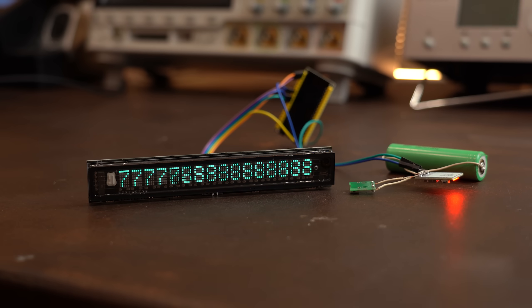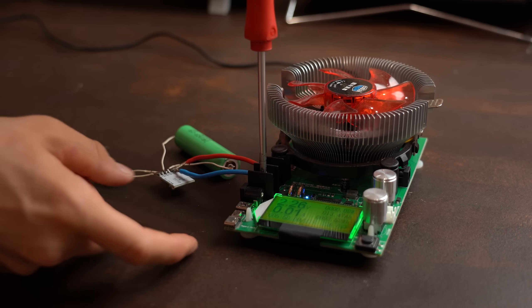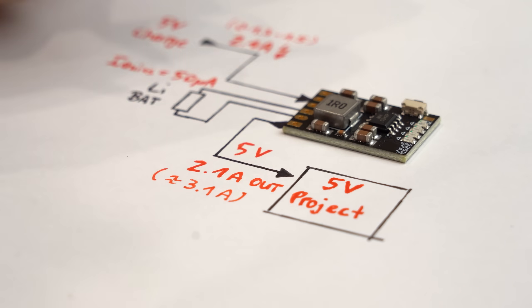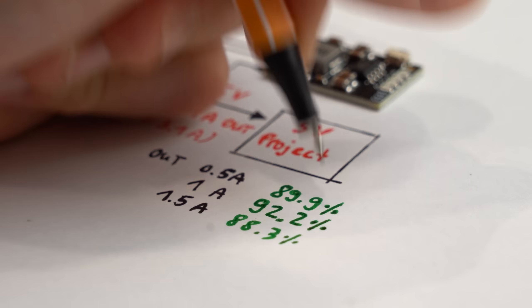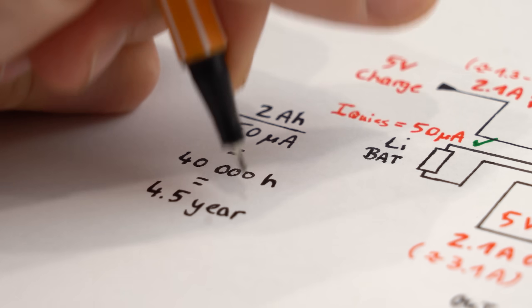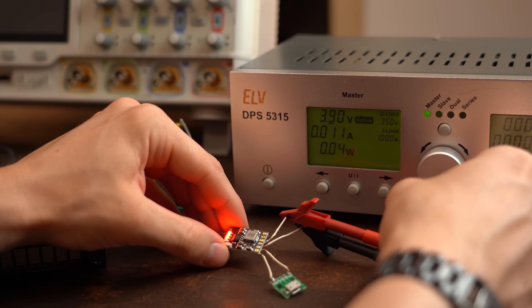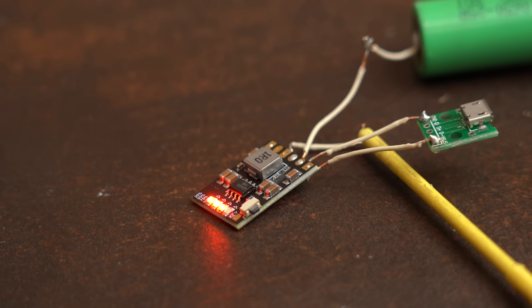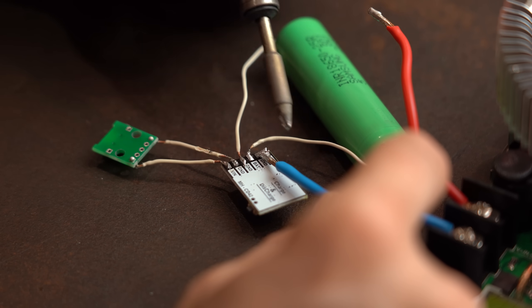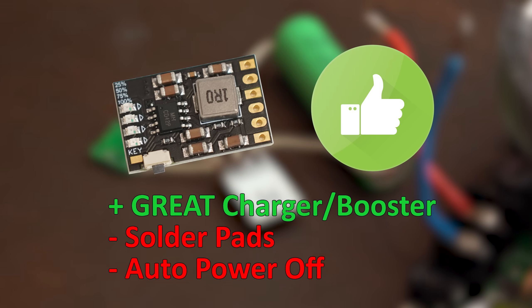We can use the 5V output to power projects even while the battery is charging. In power testing I found that the board can output a stable voltage up to 3.1A — very nice. Efficiency is around 90% — also very nice. The quiescent current is 50µA as the description stated, so a connected battery will last quite a while without a charge. The LED indicator also reacted accordingly in discharge mode. The only complaints are that the output turns off automatically if the load is not large enough, and the solder pads are so close together I occasionally feared shorting the battery. Even so, I highly recommend this board for the price.